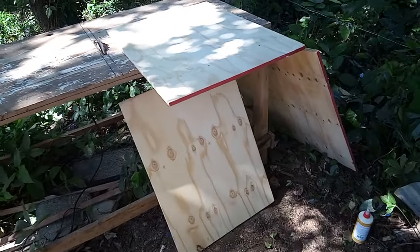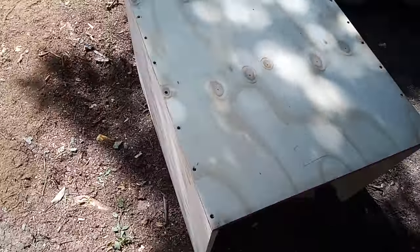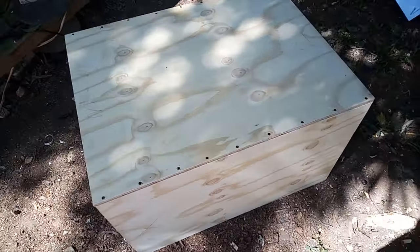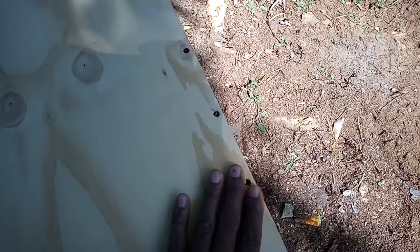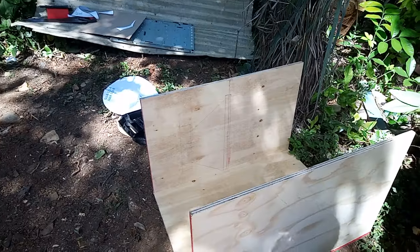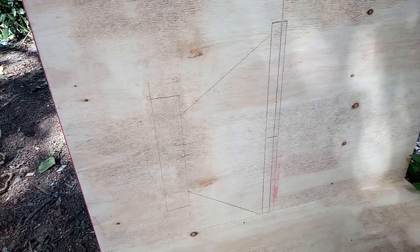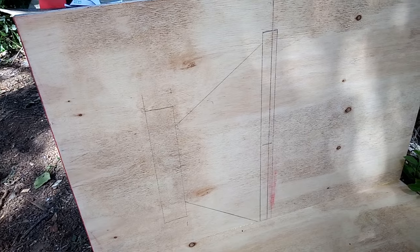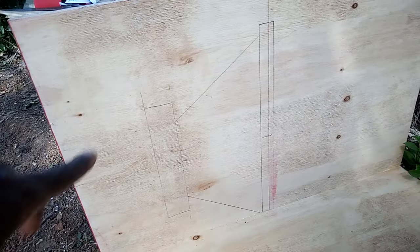Stick and stay — it's all about the sewing of the bass box. When I say 'sew the box' I mean screw them very near together. You sew the bass box because you don't want the bass speaker to open it out. The glue is gonna help as well. As you can see, I'm drawing out the speaker hole on the side of the box using a pencil — the magnet is going to face down toward the ported side.